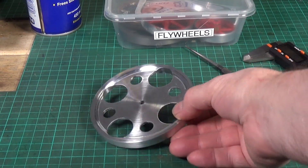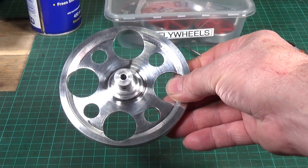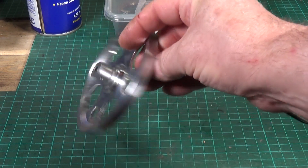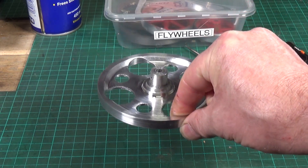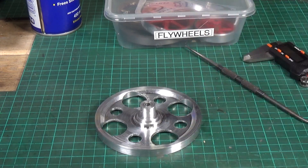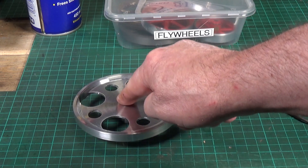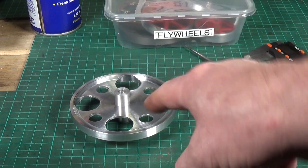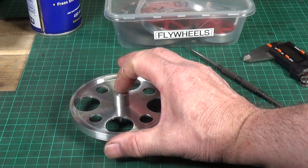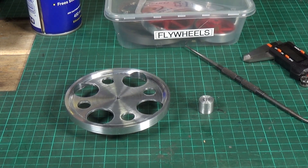The flywheel is now finished. I did decide to drill some extra holes after I machined and relieved the faces on both sides - I was still not happy with the weight, so I put more holes equidistant between the larger holes. It's actually quite light now. As a note to myself: next time I make one of these, make sure the boss comes through both sides, because if it doesn't you've got nothing to hold it when you want to machine the opposite face. I had to make up another boss and clamp it using a stud so I could mount it in a collet to machine that side. Live and learn.